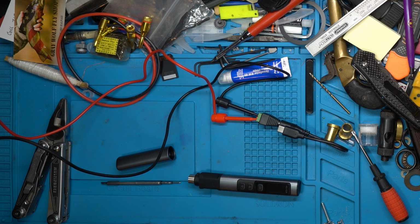But we have seen the lowest we were able to get with this setup, with that tip, this iron, and a Rigol DP832 power supply, was 20 volts supplying 2.05 amps, and it did not restart. It started slow, voltage had dropped on the iron, and recovery I think would probably be just fine, to be honest with you, once it's heated up and going. So that little bit of extended heat up time, dropping the voltage because of that, it's negligible. It's still heating up way faster than any regular iron is going to take to heat up to functional temperatures.